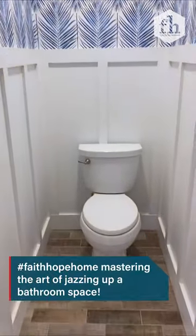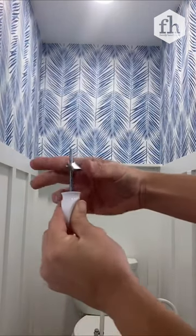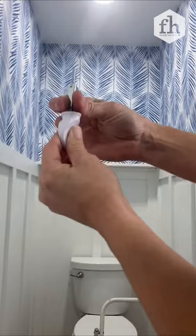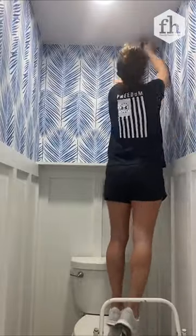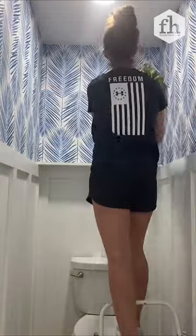Today, I'm going to hang a hanging plant and install the toilet paper holder. This is the hook that I like to use when not going right into a truss. You're going to pre-drill a hole and then fold the wings of the toggle bolt down. Insert it in the ceiling until the wings snap open above the ceiling. Apply slight downward pressure and you're just going to tighten the hook until it's flush with the ceiling. These hooks can actually hold up to about 50 pounds.